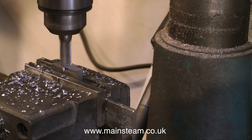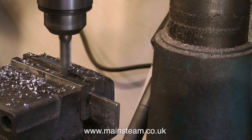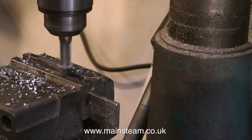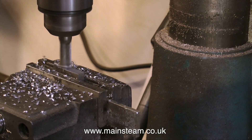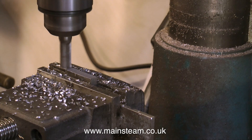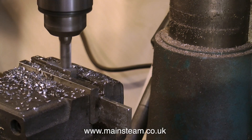Before anybody comments — yes, I do realise that this milling cutter is in a drill chuck. It's an old Jacobs drill chuck, very stiff, past its best, but it doesn't generally drop the milling cutter. I also have a Clarkson proper milling chuck, one of those you have to mess about with a spanner — really the proper tool for the job. But by the time I've messed about with the spanner and cut my fingers on the sharp milling cutter, I can just put a small cutter into my little drill chuck and off I go. It's on an R8 taper, which is a very strong taper. If I was doing a serious milling job like on a locomotive rod, I would use the Clarkson chuck — I just could not risk the milling cutter working loose. But for a small block like this, it's just not worth the trouble.